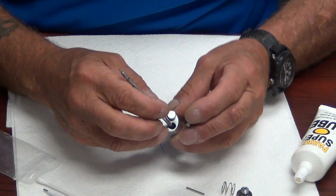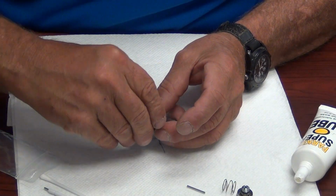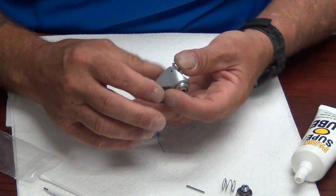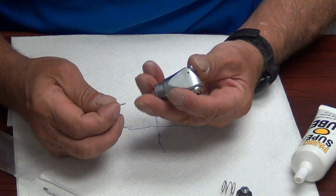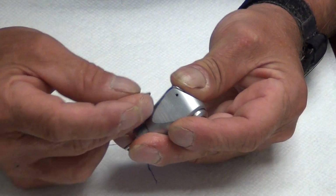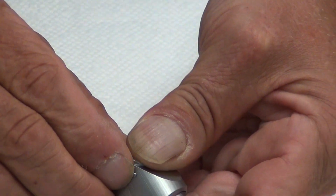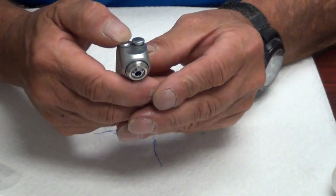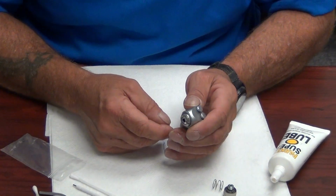We're seating our button and we're installing our button on top of our spring. This is very important, the next step, guys. Watch closely. You want to fully depress both buttons. Fully depress both buttons till they bottom out. Then replace your pin. Let your buttons up. Check your buttons for springiness and resiliency, and they feel wonderful.